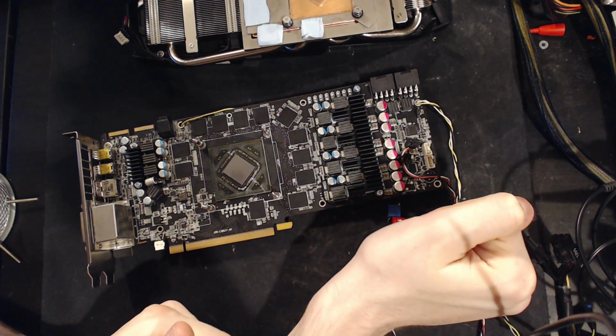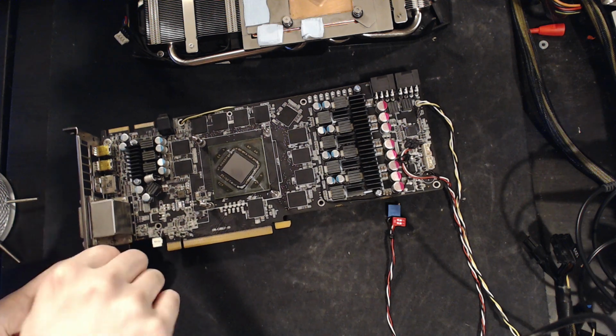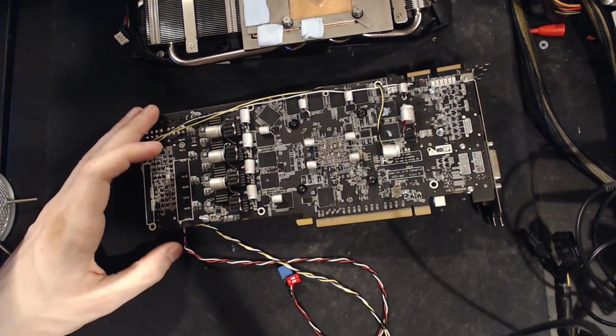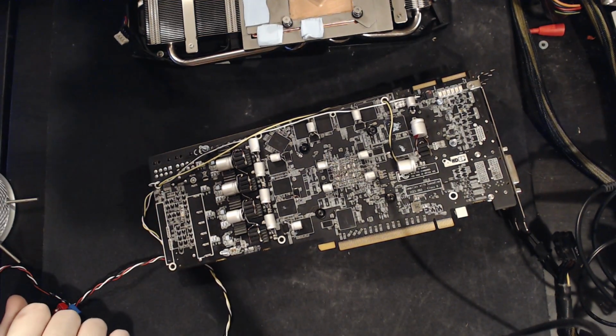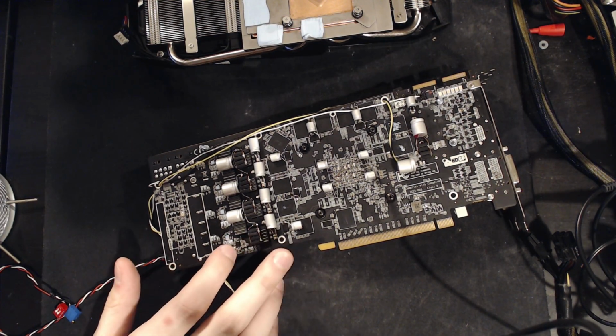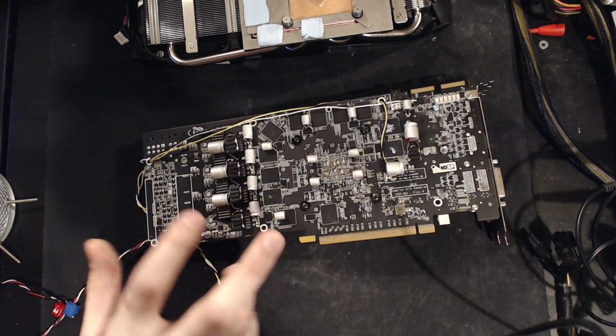So that's that. Let's go to the back of the card. I don't think there's anything on the front left. The back of the card, I've gone to town on, more so than the front of the card. As you can clearly see, we have capacitors everywhere. And this actually made a pretty major difference to the peak-to-peak measurement of the... So basically, most of these are for Vcore.